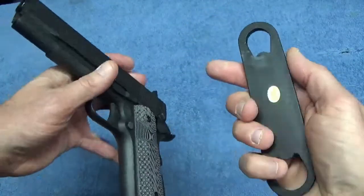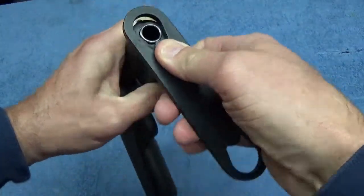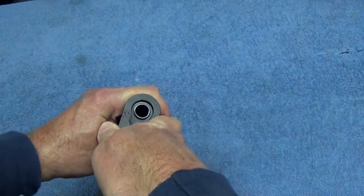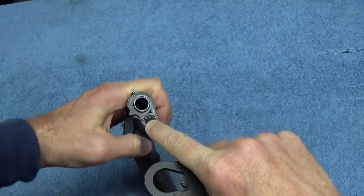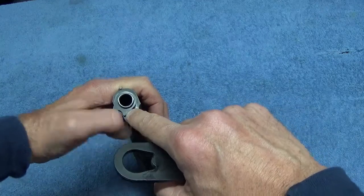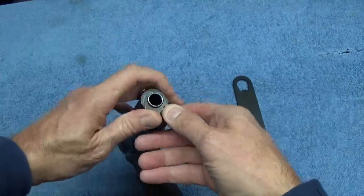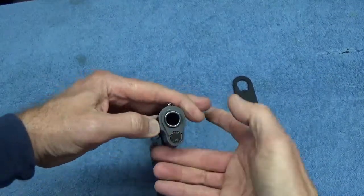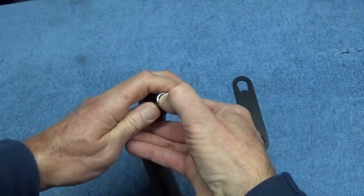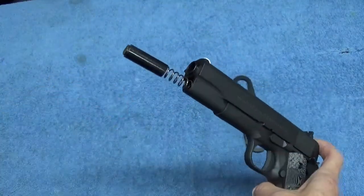This is a bushing wrench. You can get one of these to put on the bushing like this, push down slightly, and then slide the bushing the way I'm doing it right now. You want to watch this piece and make sure that it is retained on the edge here. If you pop this all the way out, this is going to fly out under spring pressure. You can do it with just your thumb and turn it like that and then slowly guide it out, but especially if this is oily it's very easy for it to slide out.